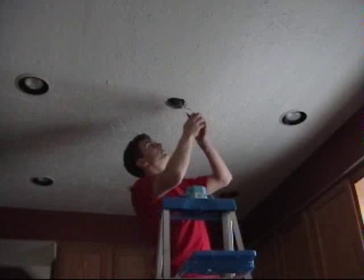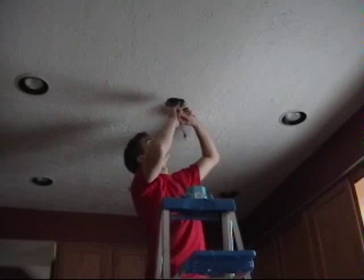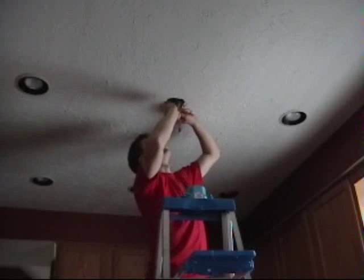So right now I'm going to take the probe and connect it up. It doesn't really matter what you connect it to — do the hot and the neutral wire. Now what I'm going to do is take the continuity tester and check it with the unknown wires here until I determine which one the light fixture is on. Again, there's no power running to this right now — it's the only way I'm able to do this.